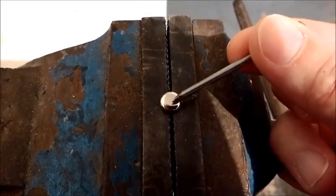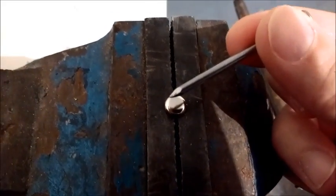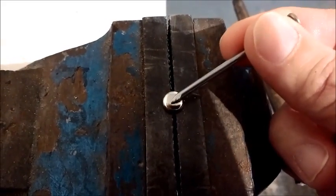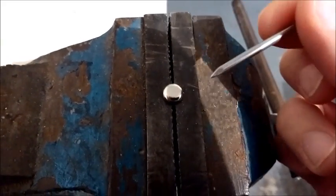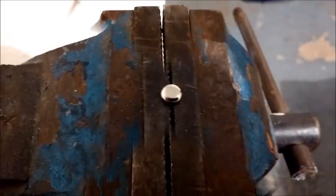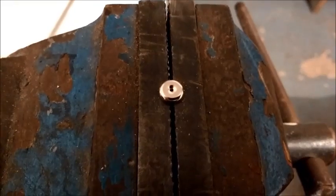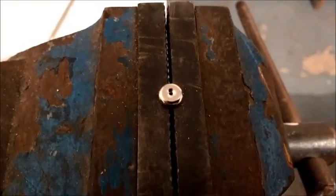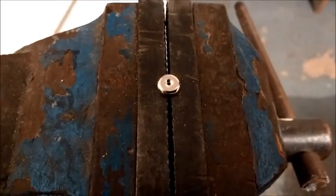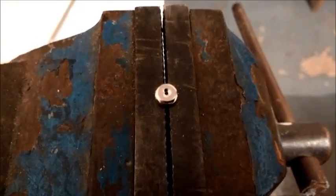Punch a hole in the center of the tack with a nail. This will at least get you started on gradually opening up and creating a hole for the LED light. You just lightly tap it with the nail and you've basically created a little hole. This will get you started on allowing yourself to create a larger hole to put in the LED.